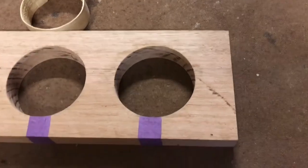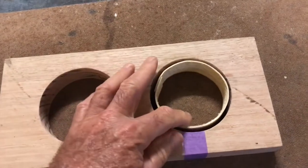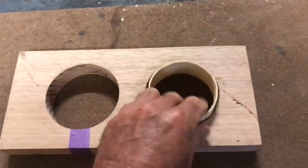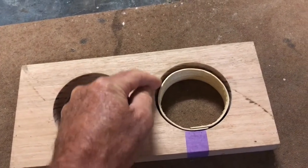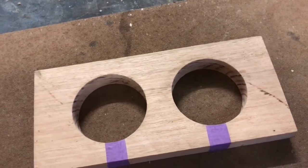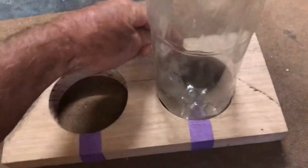First of all I'm going to bring in the little mold that I'm using. The first stage of the improvement was to increase the size slightly. I've gone to a 92 millimeter hole and the section is just that little bit larger than the old ones. The cramping force that I used to use — I just used to put a cramp across this area here. That often meant that there were little gaps around the edge of the mold and what I really wanted was a cramping action in all directions. I'm just using the old 1.25 litre bottle and I can use that to supply the extra cramping force I need all the way around the outside.